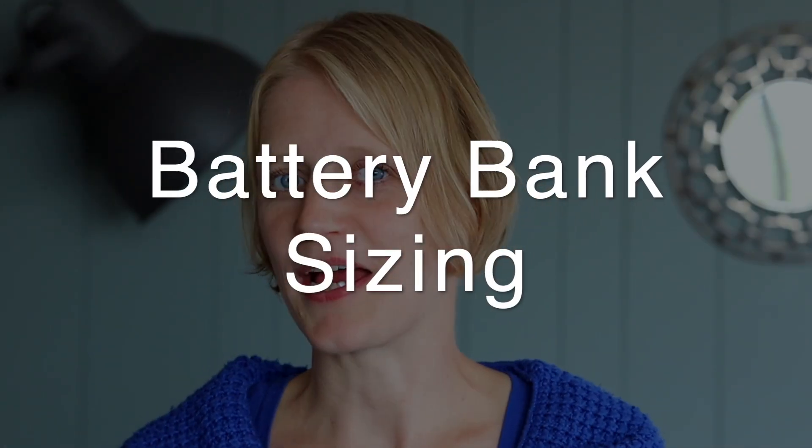It's the most popular system in Germany for new buildings. So how do you get from the size of your heat pump system to the size of the battery bank needed at night? If you want to go completely off-grid, you should have a bit more of a buffer. First, decide on the type of battery. While lead acid are still often considered an option for home battery storage, I highly recommend lithium ion. It's usually the right choice given its many advantages: longer lifetime, higher efficiencies, and higher energy densities. Lithium ion batteries are usually more valuable than lead acid despite higher upfront costs — yet another upfront cost versus lifetime cost decision.